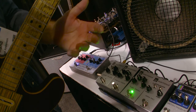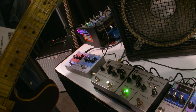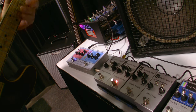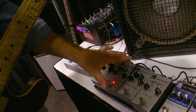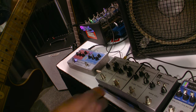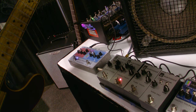I still hear the string spacing and the articulation through the strings. But if I want to go the other way, I can also turn it into a high gain tone. Very pure transparent tone here, high headroom. Moving along, we have the Tremutron. This is an optical Tremutron — basically our own circuit design that incorporates the preamp from the Mutron 3. We use an optical circuit to offer you sine wave to a square wave sort of effect, and anything in between.